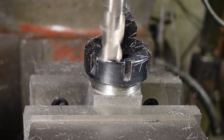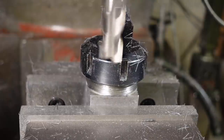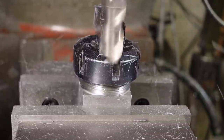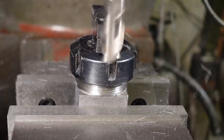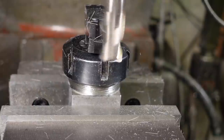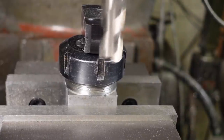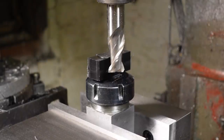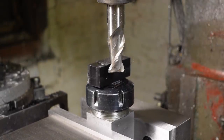Thickness looks good, so now I'm going to put a flat on each end. I can't extend the flat to the full width because the original material diameter wasn't sufficiently large. Next operations to deck the top to the finished height.